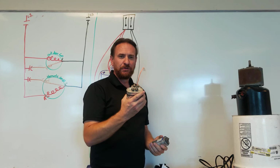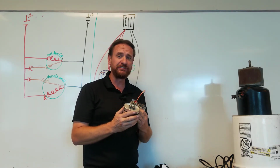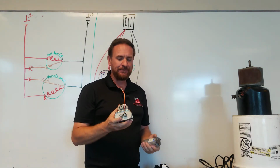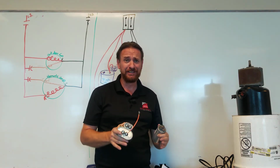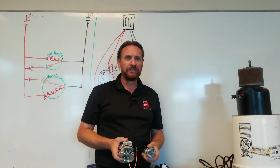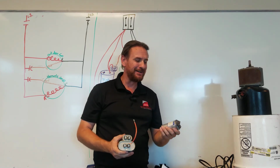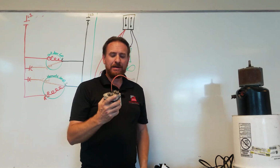I can stock more of these on my truck. I know that having 2 separate capacitors is more surface area. It's going to stay cooler, and if one goes out, it won't take the other one out with it. So I've had really good success. The brand that I like, I'm getting no endorsements, no money for any of this, is Amrad Made in America capacitor, good quality capacitor with quality assurance. I've never had an Amrad capacitor go bad yet, although anything made anywhere in the world can fail. I do love their capacitors.